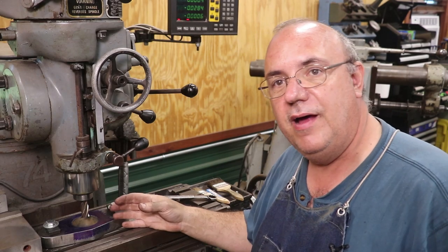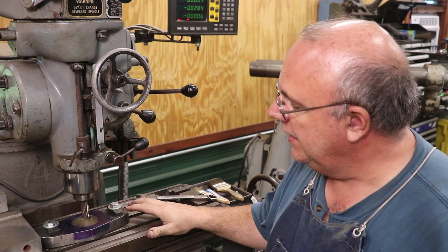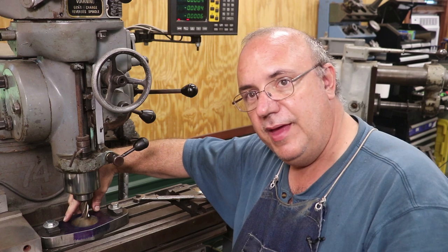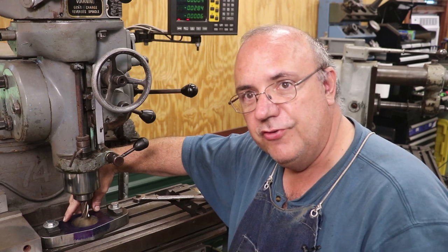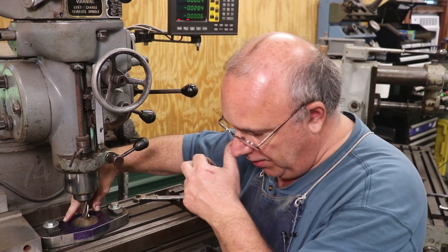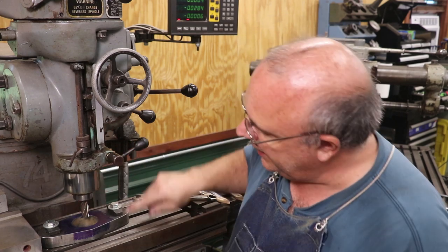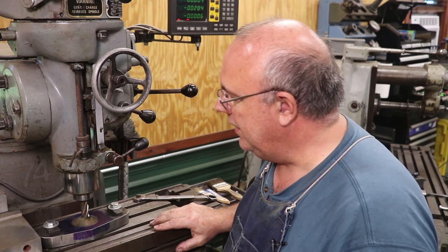Ready now to modify our flange here to make it where it's ready to kind of fit up on there now that we know where we wanna be. I've already kind of laid it out on here about where I want it. I've measured the maximum width of the pipe over there, and to give me just a little bit of clearance room in there, wiggle room to get everything just where it needs to be, and so that I have a place for some braze to fit down into as well. It needs to have basically a slot in here that's 3 3/4 inches wide. And I want my depth to be 3/8 of an inch based on the measurements that we were able to make in the locomotive.